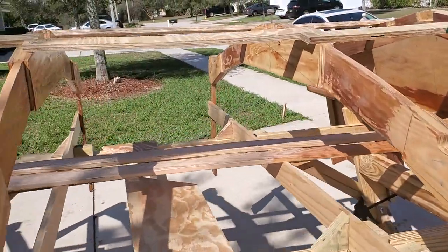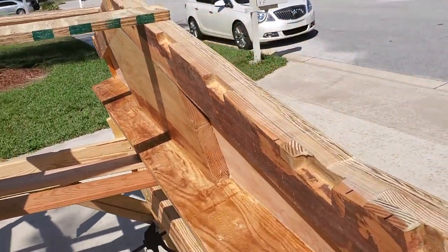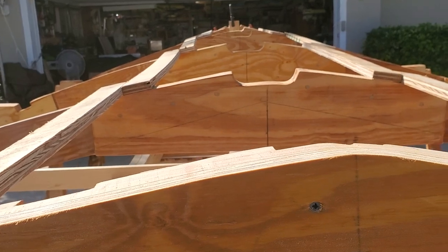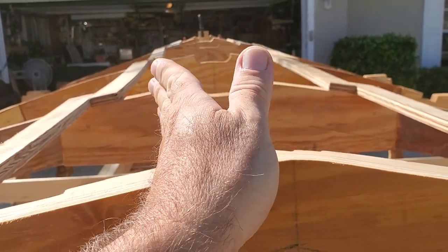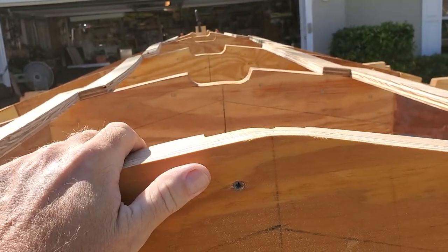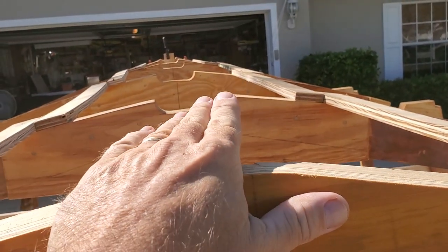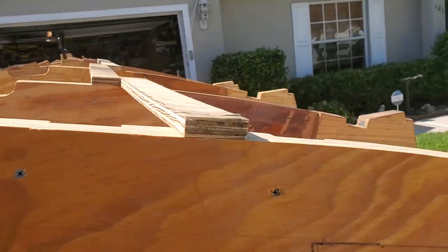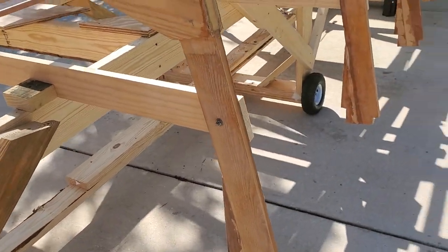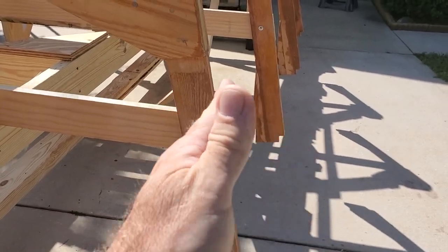Nothing has been aligned from left to right yet — each frame needs to be maneuvered a little bit over. When I do the gluing up process, that'll be ironed out perfectly. I'll get it straight from the keelson as best I can, then I'll run a batten or a string and see how it looks, how fair it looks — whether one frame is in or out, whether I need to add or subtract.